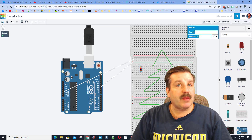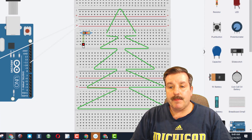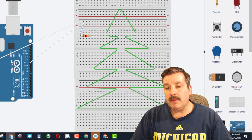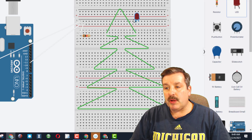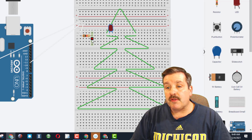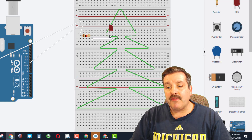The next step is to bring out a resistor — we use these to limit the current to our LED. Rotate it four times and put it in pin 1 and pin 5, then move it down one chunk. Connect the electricity from pin 1 down to the first hole. Bring out your first LED — you cannot put things in the plus or minus row, you've got to go down below it. Put the first light in the row 11-12, then go down to the end of your resistor in row 5 — those all turn green to show they are connected — and connect it to the anode of your LED.